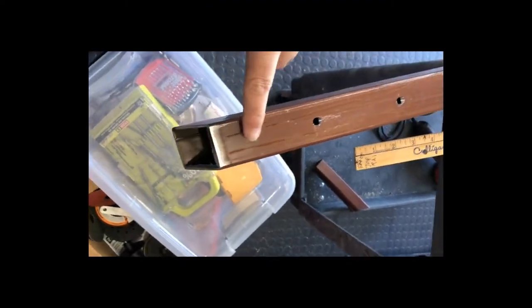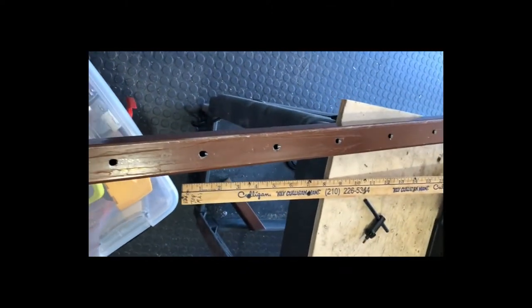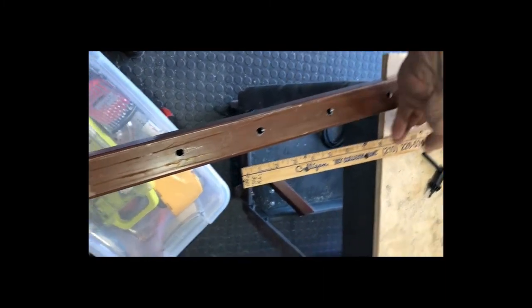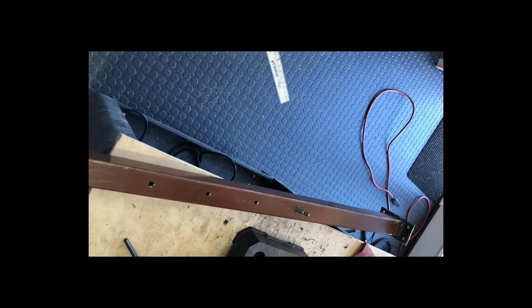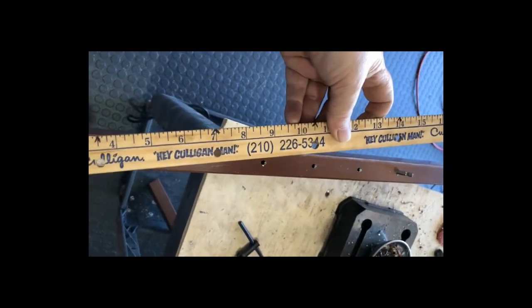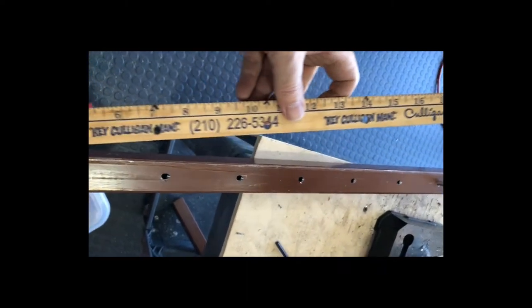Here's the one and a half inch 16-gauge square tubing I'm using for the posts and for the railing. This is an end piece - it's going to be at the bottom of the stairs. I've mounted a little steel bracket on it to mount to the concrete, and I used a little template I made out of just a yardstick with holes punched every three and a half inches.